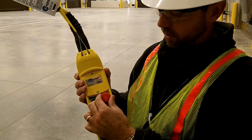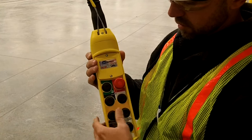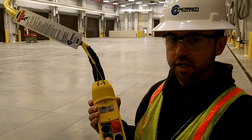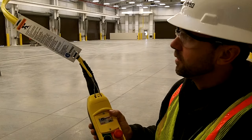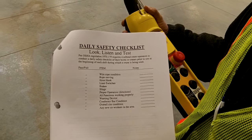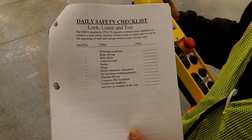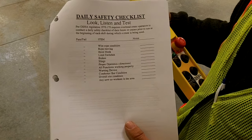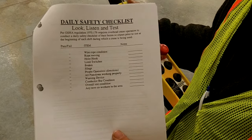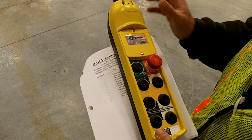To turn it on, you release the emergency stop — it's spring-loaded — then hit the start button. We'll later show that there's a green light on the panel that indicates power is now on. At this point, I'd like to go through our standard checklist that we recommend at the beginning of each shift. Someone goes through this checklist and verifies these safety features are operational, and it's an opportunity to visually inspect and make sure nothing has changed since the last shift. So to start, we turn on the crane, which I've already done.